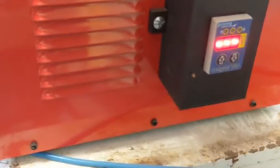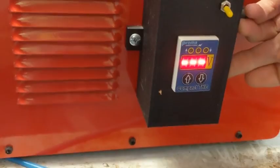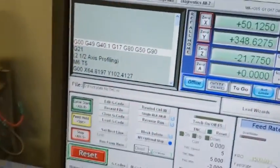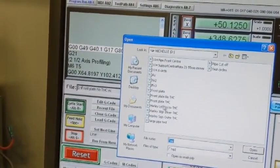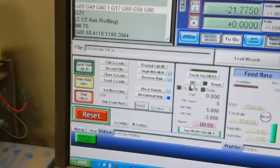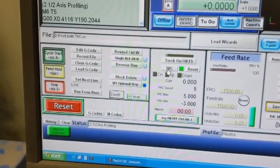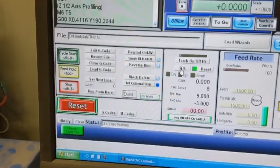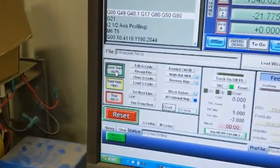I'm just going to set this to the right voltage — it was at 118, so we've got it sitting on 100, and we'll run it at 108. Just loading some more G-code — we've finished cutting that, so we'll load the next bit, which is the front plate with the THC. Switching on the torch height controller — I hit this button here, so it should now respond to the signals from the THC. Hit the start cycle. It moves to the start position, touches off, it's on. Moving up, moving down.